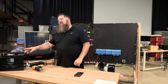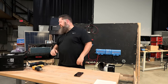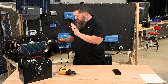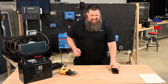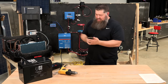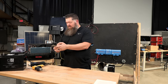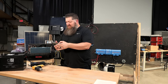The question is: even though it's got three batteries' capacity in the same space, can it handle the amp output? Here's something new with lithium batteries — you need to look at their charge and discharge profiles. When you buy lead acid batteries, you just match the group size. With lithium, we have to look at performance. I have everything set up, including a soft start, and I'm using the Peacemaker to turn this on since I don't have a thermostat here. This battery has Bluetooth, so I'm going to monitor everything as we turn stuff on.